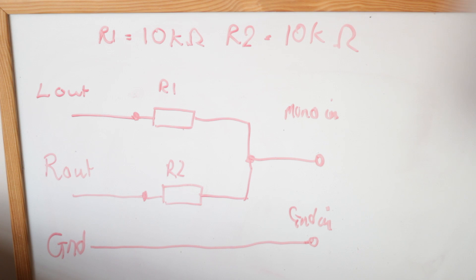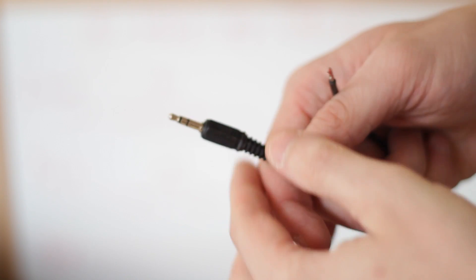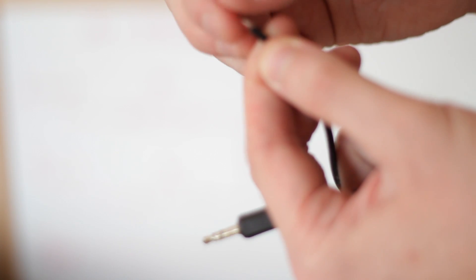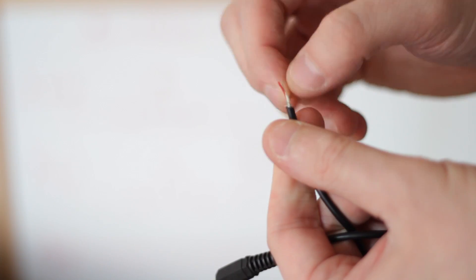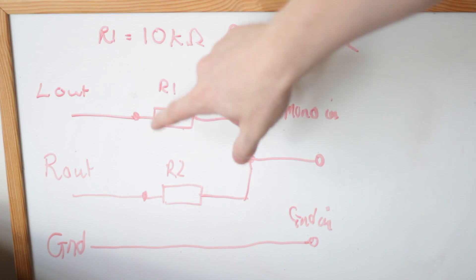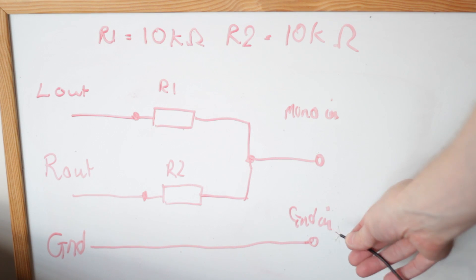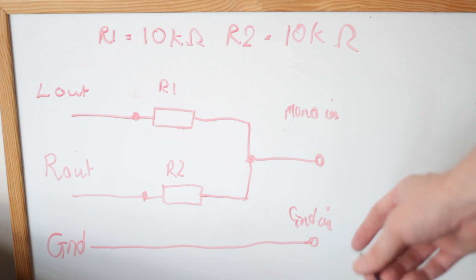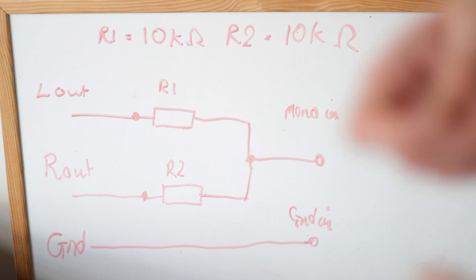So I've got one of these small stereo cables here. As you can see at the end, I've just stripped off some of the wire — around the outside there's a red wire and a white wire, and around the outside is some shielding. That's actually the ground connection. So you need to connect the shielding to the ground. The left and right — I'm not sure which is which, the red or the white — but it doesn't really matter if you're summing them anyway, because it's all going to come out of one speaker. You're essentially mixing the two signals together.